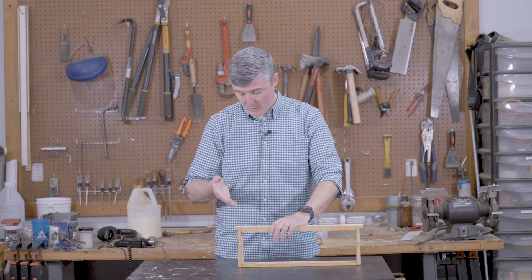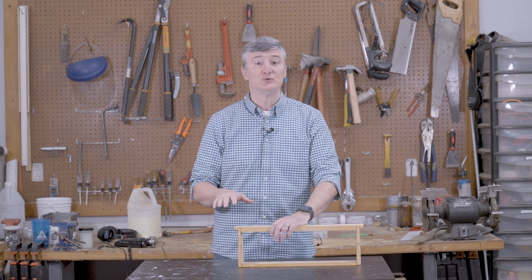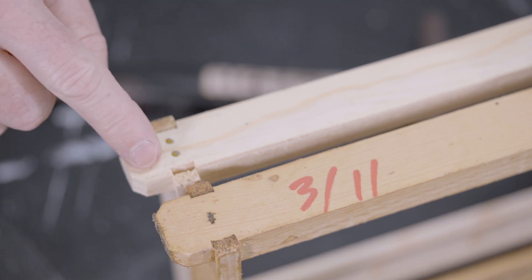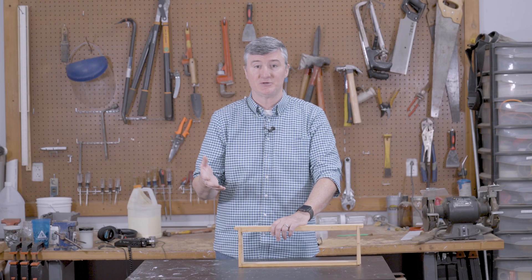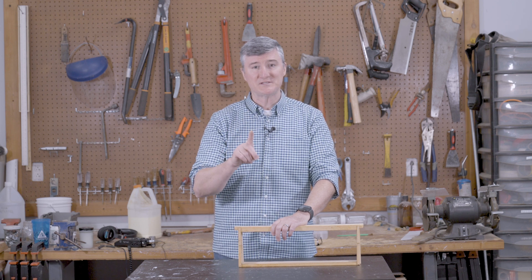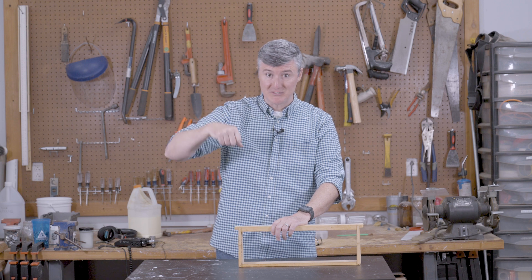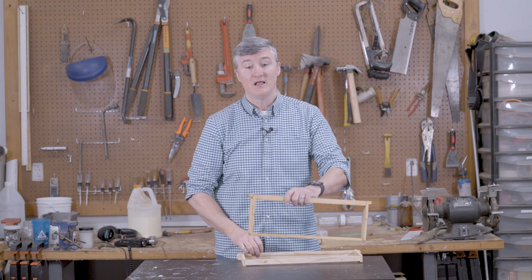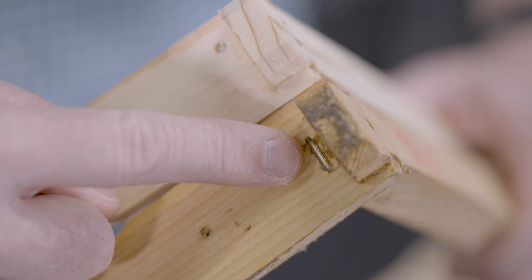Here I have two medium frames — one assembled the traditional way using nails, and the second assembled using staples. A lot of beekeepers like to use staples because they are a quick, easy, cheap way to assemble a lot of frames efficiently. Usually if you purchase frames already assembled, they will be assembled with staples, administered using pneumatic staple guns. If you elect to use staples, remember: one staple has the power of two nails. Continue to use wood glue as well as that magic nail — or in this case a magic staple — on both ends and through the side of the bottom bar to ensure that your frame is stable.